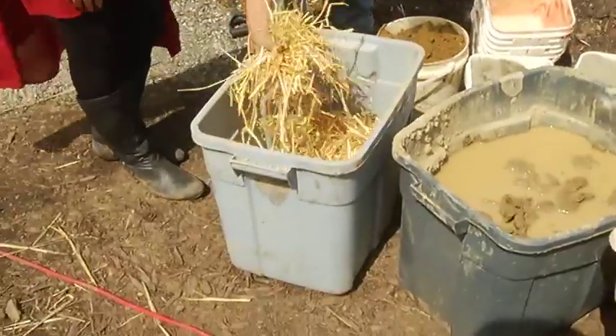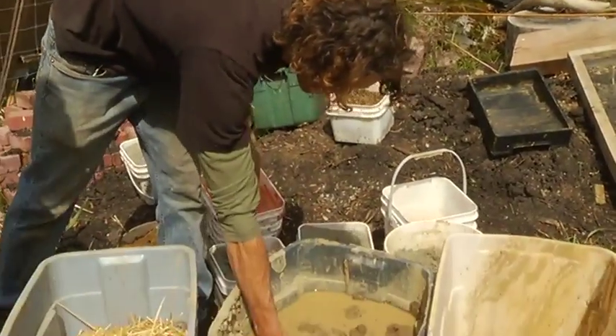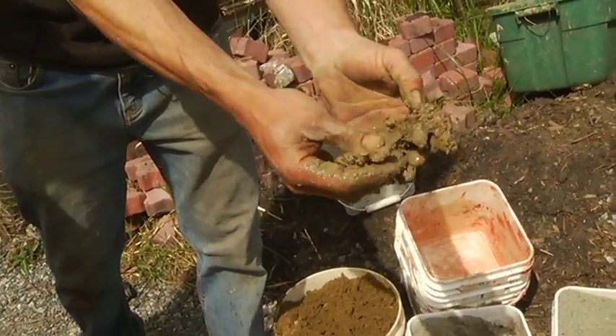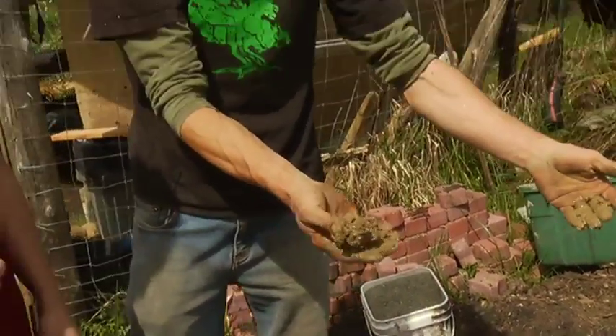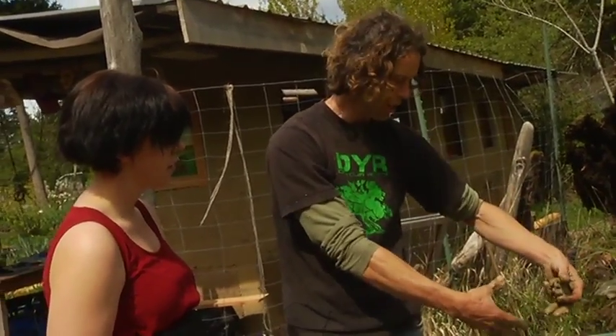The second ingredient is straw, which is a waste product from farming. And then there's clay — this is on the island, from a guy's pond that he dug out, so we've got basically as much of it as we wish. The trick is to slide those platelets over the sand and the straw, and then when the clay dries and shrinks, it pulls it all together and tightens it up into a brick.